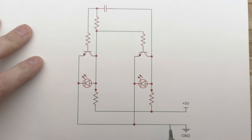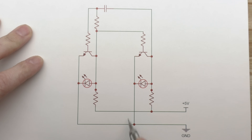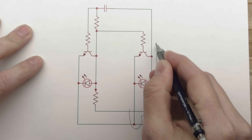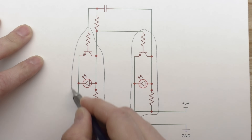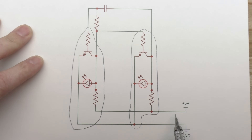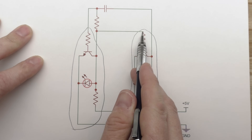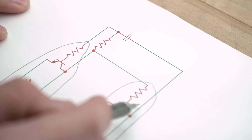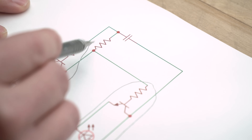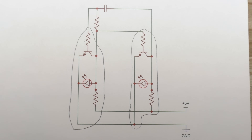Here's the schematic so we can see how everything's hooked up. We have two inversion circuits — here's one, and here's the other — connected in parallel. The only two components we added were: a wire from the output to the input on one side, a capacitor from the input to the output on the other side, and a resistor in between on that side to recharge the capacitor. Without going into all the details, that's the basic wiring diagram of this oscillator circuit.